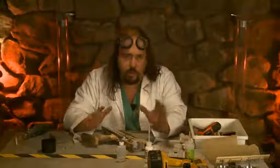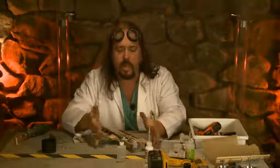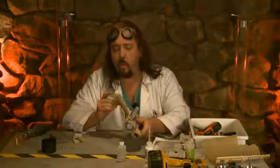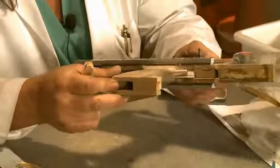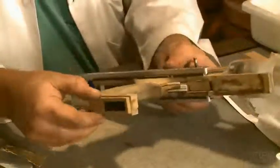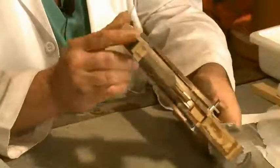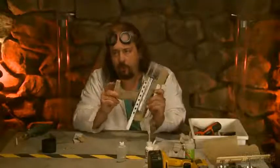So that will all be dressed out. What you're trying to do is block it — you want to block it first. You want to build out the large details and save the small details for later. You always start out with your engineering and work from the inside out. For your battery pack, if you're going to put a battery in here eventually for a MIDI player or even speakers, I just dressed out a little piece of detail that fits and it just drops in there like this — almost like a little access panel. You just cut it out on the bandsaw and sand it to fit. These are little nernies and greebles, and that's what our business is all about. Those are the little details that will eventually really sell your piece.